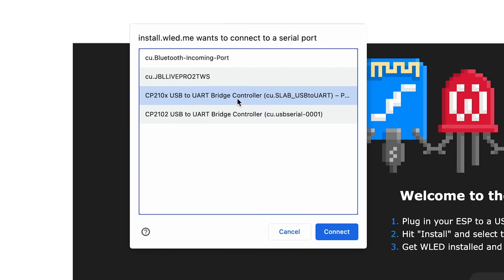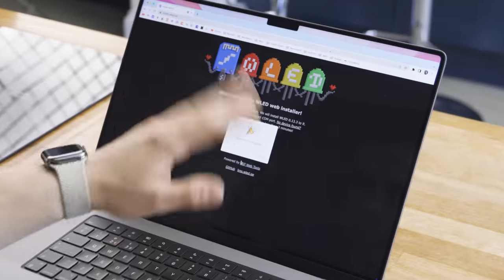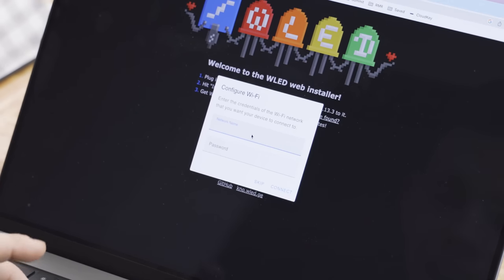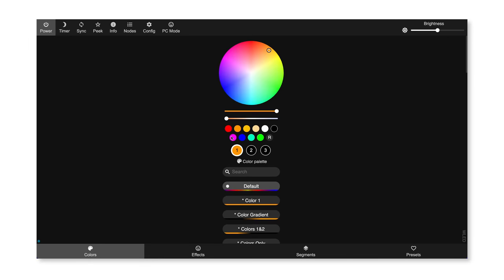Choose the development board — the one we've just plugged into our computer — click connect, and then click 'Install WLED' and install. That is it. Installation complete. That literally took all of two minutes. Click next and now it's going to ask for our Wi-Fi password. Enter in your Wi-Fi details. It's taken about three minutes to install the WLED software on our development board and tell it our Wi-Fi password. Once it's connected it will say 'visit device' on your screen. This device has connected to your Wi-Fi and given itself an IP address — I'm connected to mine now at 192.168.55.88. This is the main console for WLED.